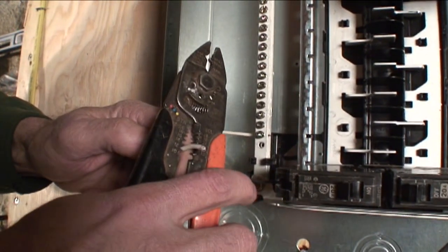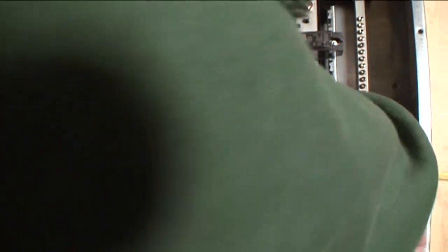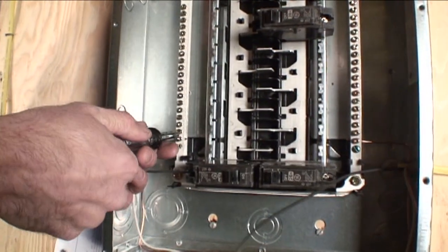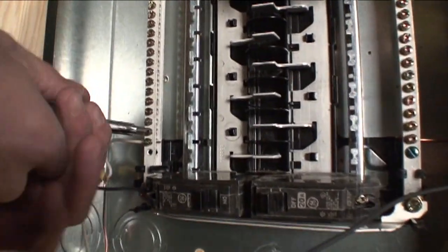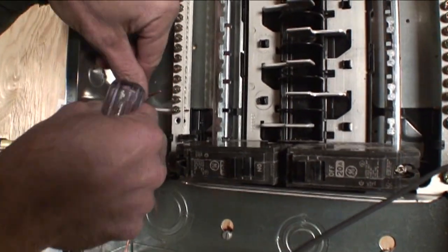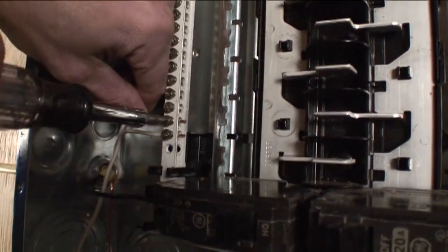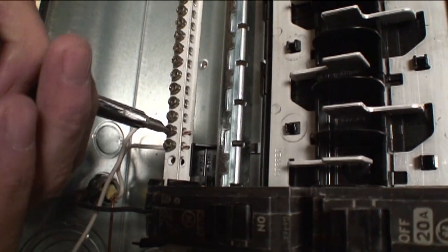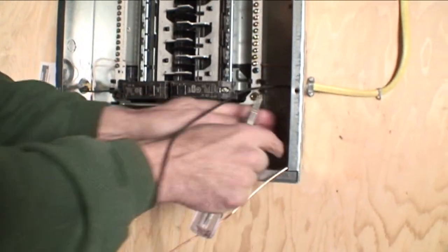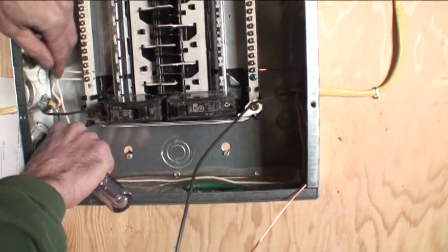We've got 12-gauge wire, so we'll go into a 12-gauge stripper and strip that back. I'm just going to straighten that out a little bit because it gets bent with all the machinations here, and we're going to loosen up this fastener. We're going to run this wire behind here so it's out of the way, snake that in there, just have it come through. I'm going to tighten that down, and now we want these wires to be nice and square, smart-looking.